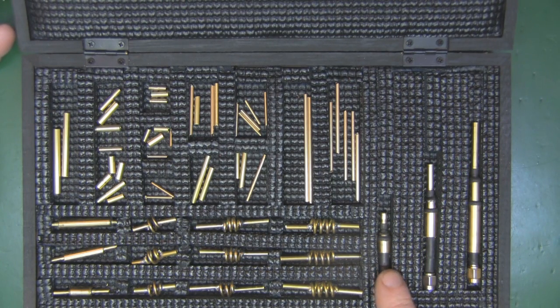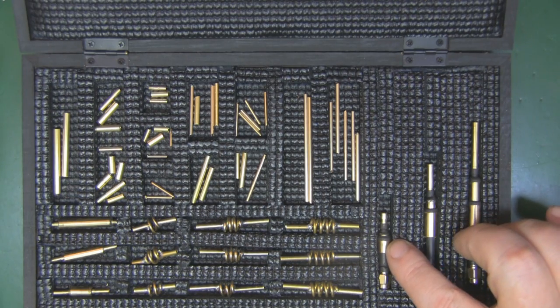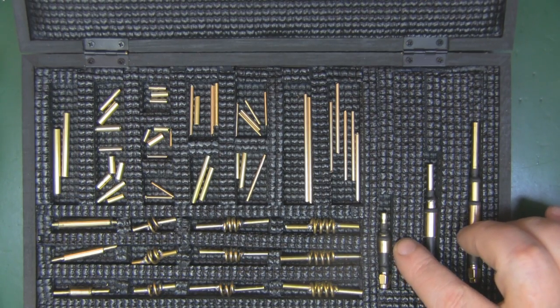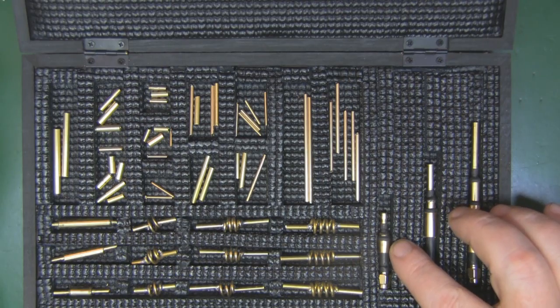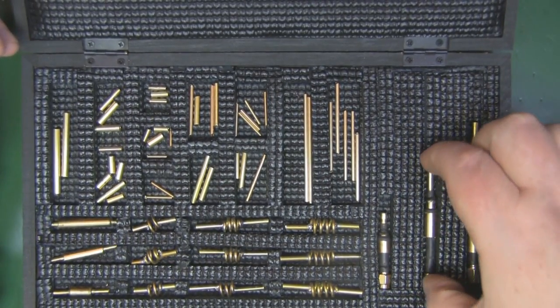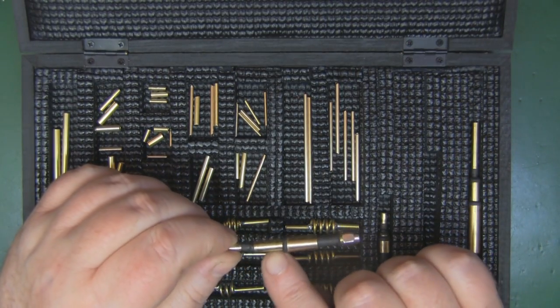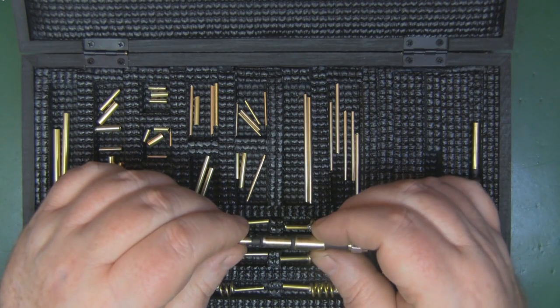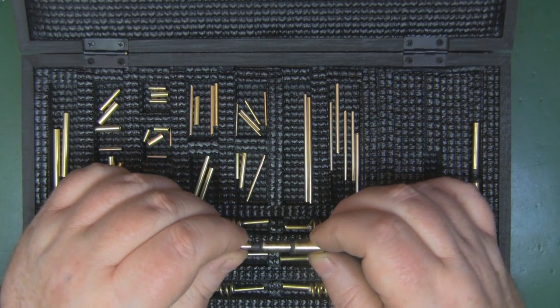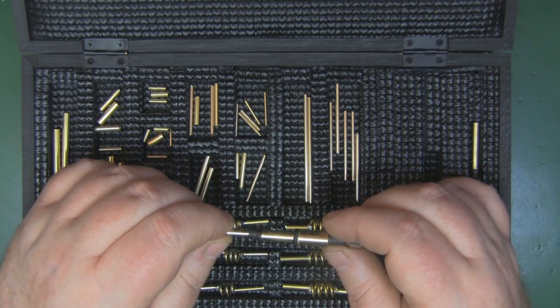You can make prototypes between 6 gigahertz down to 5 gigahertz with this one here, but I want to make this one a little bit shorter, just so I can expand it a little bit more into the low 6 gigahertz region. So you've basically got your three dipole platforms here. This one's the 2.4 gigahertz one, and here we've got the ground plane, and this one is just fixed adjustable here, and you can move that, make it smaller for different frequencies, or make it longer here.